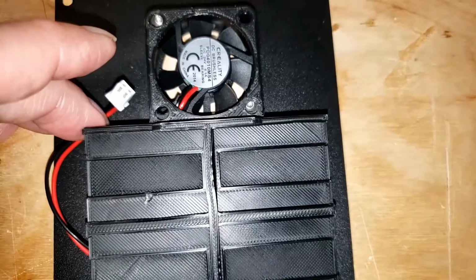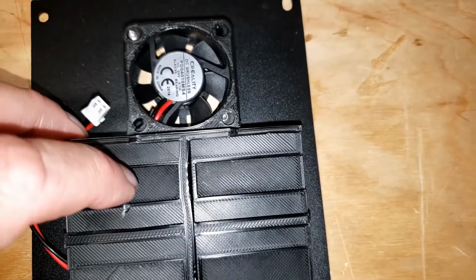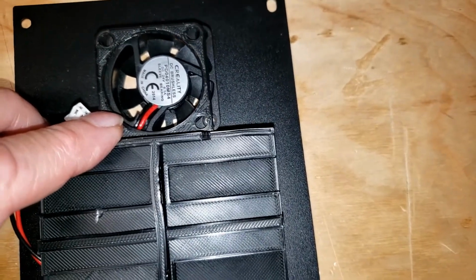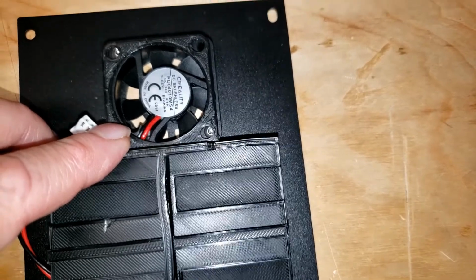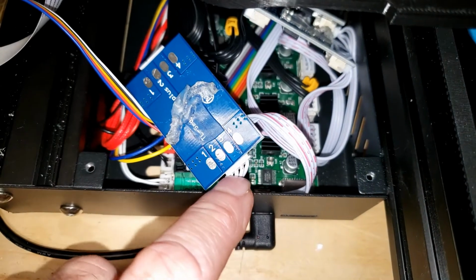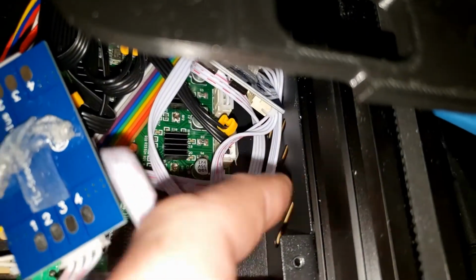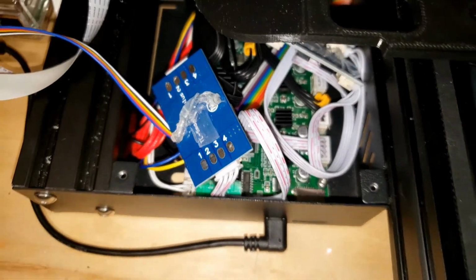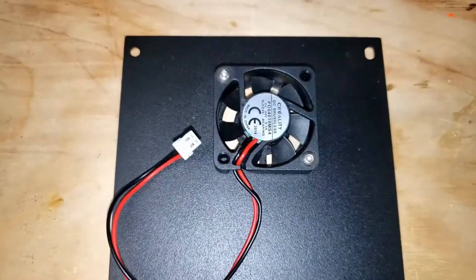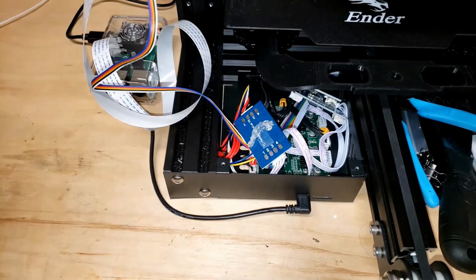Now I guess I could try to reprint this and slide this part over on the slicer program a little bit, because the problem it created was the ends of the stepper motor smoothers. This cable right here was just crammed against the side here because that piece of plastic was not centered, actually, because the fan's not centered. I took that plate out.